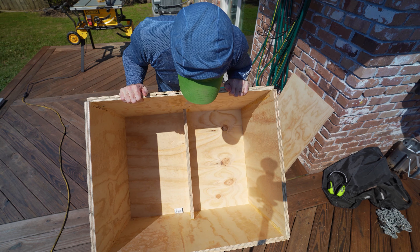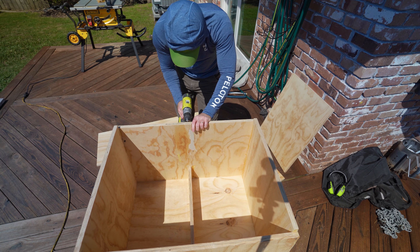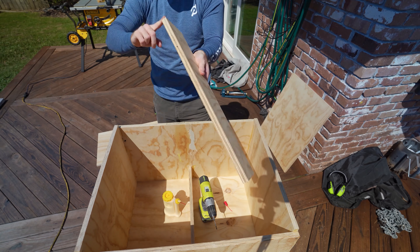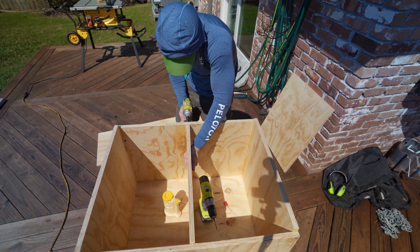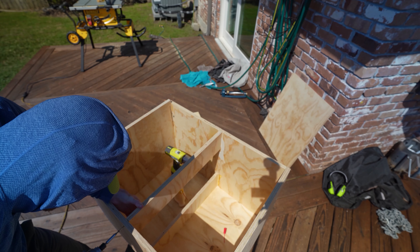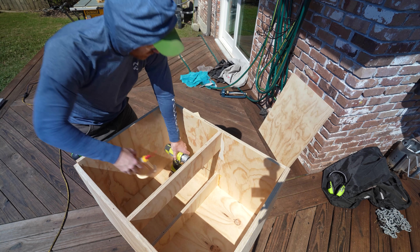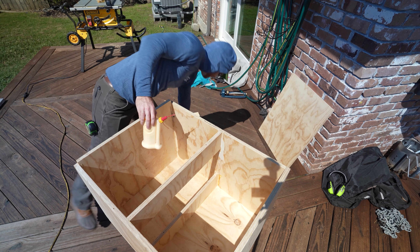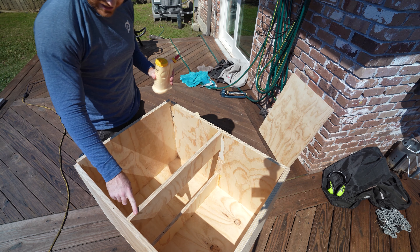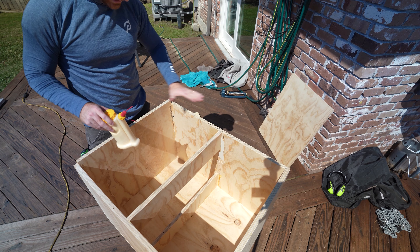That brace is now in there. For the last panel we're going to put on, it's going to be a lot of glue — glue all along here, all along here, across here. I suspect it's going to be hard to get this panel in and will take a lot of finagling. Because this was cut at Home Depot, it's not perfect or perfectly square, so this last piece could take some hammering. Let's dry fit it first just to see how it does.